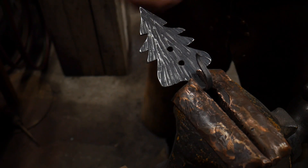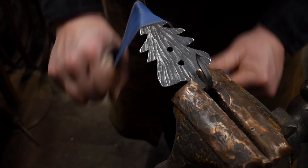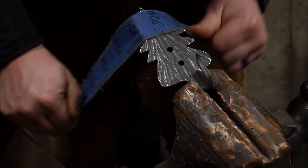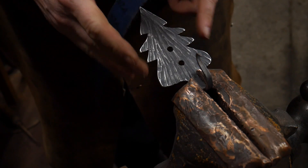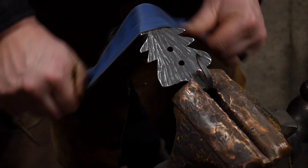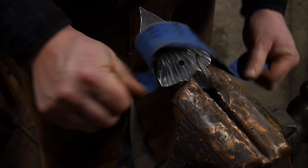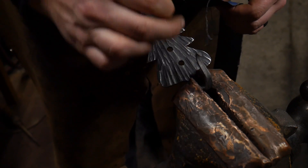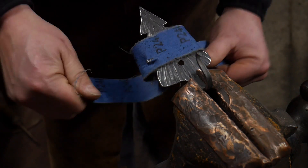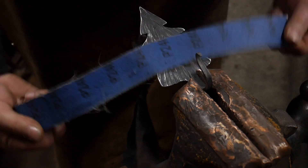The final portion of the project is to use 240 grit sandpaper to highlight all the edges. The benefit of using sandpaper over an angle grinder or belt sander is you get a really nice smooth finish without any flats or beveling of the edges — you get a nice rolled-over edge and it's a very pleasing look. If you have heavier forging scale you could start at 180 or 120 grit and then move up to higher grit afterwards. Use the sandpaper exactly as you see me doing here.